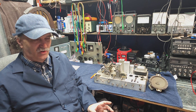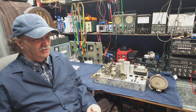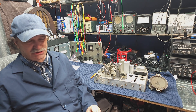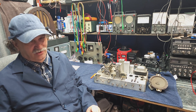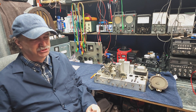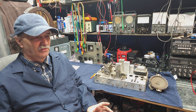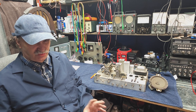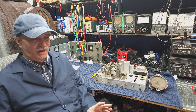I have a little OCD with this, which goes back to an old friend, Bill Fultz, who worked for the Hammond Transformer Company. He designed tube equipment and transformers his entire career. His ideology was that if he designed a circuit with a 1,000 ohm resistor, that's what he expects — not 1,100, not 1,050, not 950, but 1,000 ohms. So when I see a resistor has drifted over 5 or 6 or 7%, I usually replace it. Tightening up the resistors — especially anode cathode and power resistors — can seriously improve the performance of your radio.